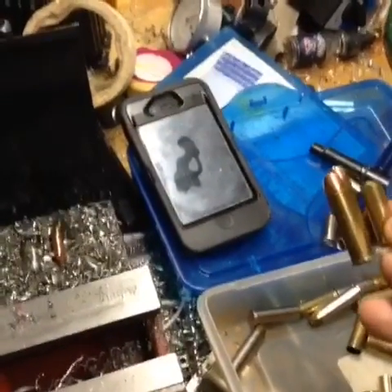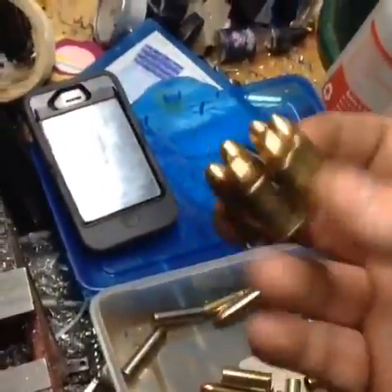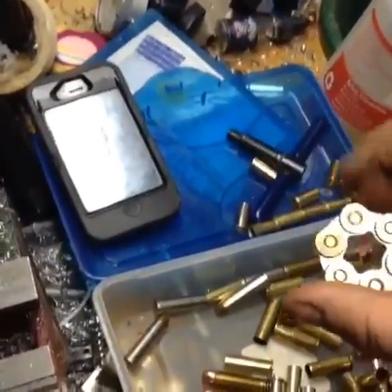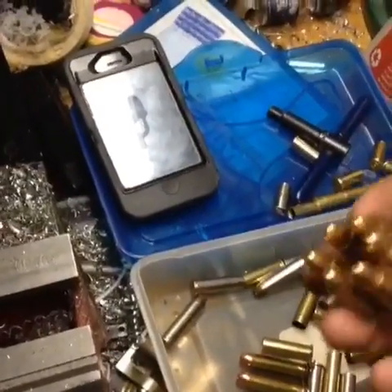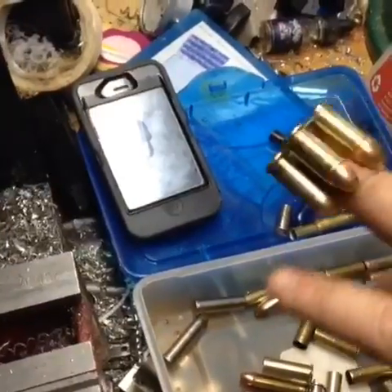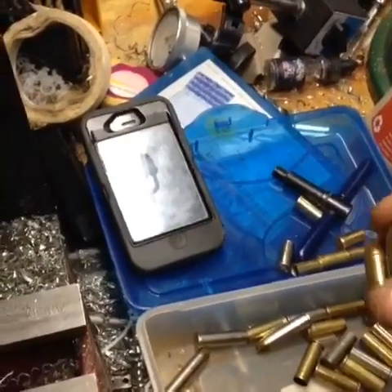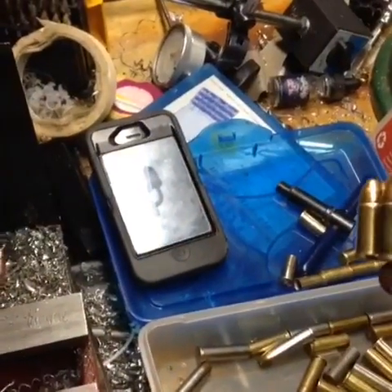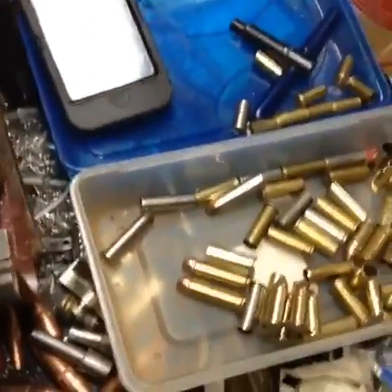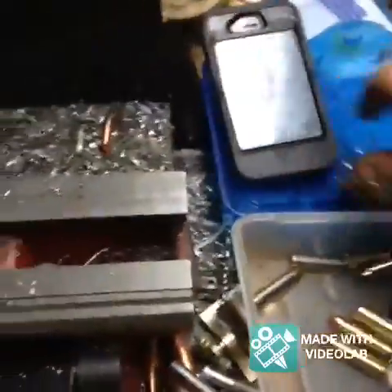I know what you're thinking — why not just shoot 38 Special? Because they're a little bit shorter, you still have this problem where they fall over, so it still won't load. This is the best way I found to do it without having to buy another thousand-dollar Chiappa — and if anybody's ever priced one, they're pretty expensive. The only place I've found moon clips is TK Customs. I had to make a set of dies — I'm using a 38 Special sizing die, took a 38 Special seating/crimp die and turned the bottom off enough to crimp these. I'm using a 9mm charge die on my Lee press and loading them with H110 powder to really get them going.